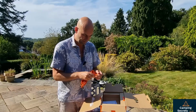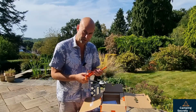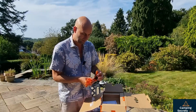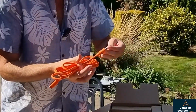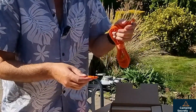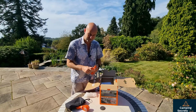So for instance here, this is the cable from this new solar panel, the 40 mini, into the power pack. The 300 plus uses a DC 7909 connector, but some of the older solar panels use an 8020 DC connector. So you've got the 8020 here, then you've got an 8020 to DC 7909 connector like that, and then you sometimes might need to then use another connector to take from that one into a USB-C to then charge. So, yeah, I'm not sure why Jackery do this.